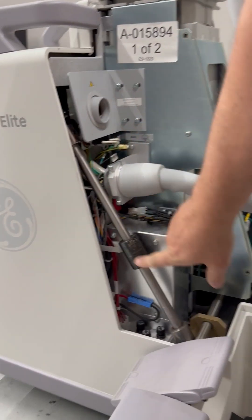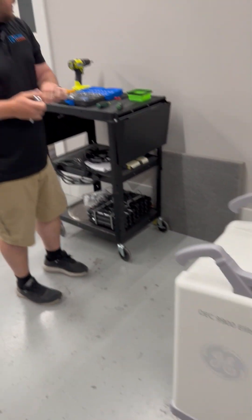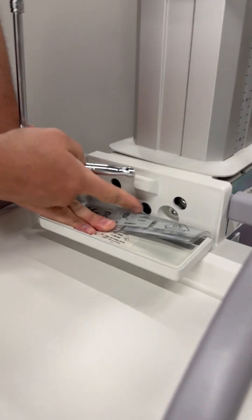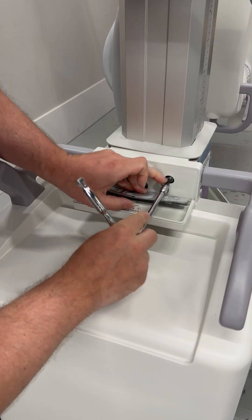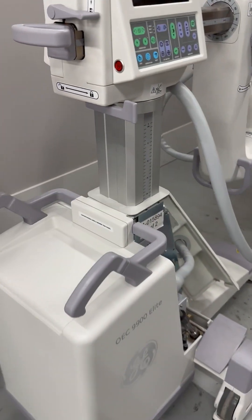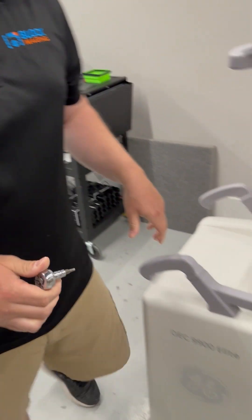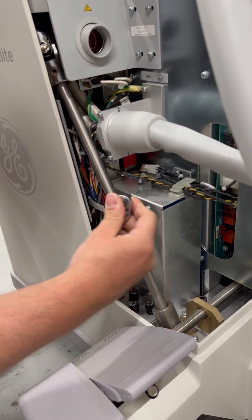That's going to expose our steering shaft here with the knuckle. You're going to want a quarter-inch Allen to open up this access panel — there are three screws located inside here. We're going to loosen those up and remove them. Where that knuckle is, we will need a 5/32 Allen, and there are four screws located on there. We only need to loosen up the top two.